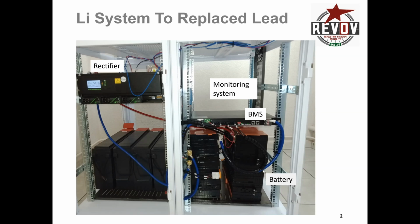The cables here, these are all the 25 mil cables, and then this one is a small one. I think it's like a 5 mil cable, maybe even less, 3. They are spec'd for basically a half-meter run on DC, and they're all the right lengths and everything, but most of my clients actually prefer to go to 30 or even 50 mil cable, 35 or 50 mil.